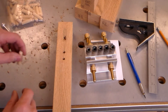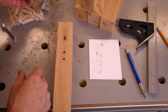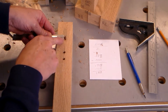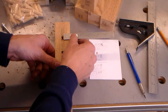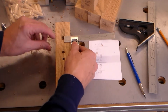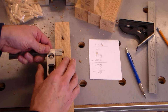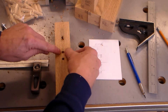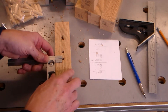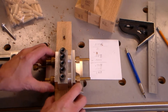The problem I was running into was getting the holes centered. I took my jig and used the spacers that come with it. In the first setup, if I registered from one side the hole was on the edge — it was off. I messed around with shims and got close, but the holes were still slightly overlapping. I made one more little adjustment to the shim and now I'm as perfect as I can get.